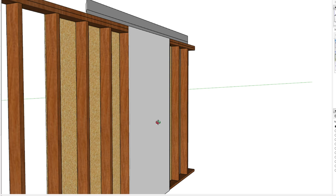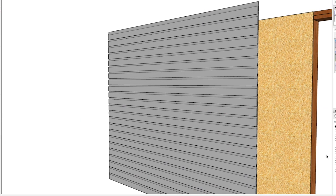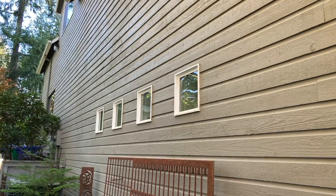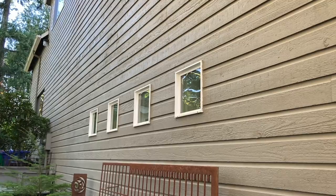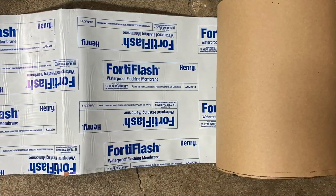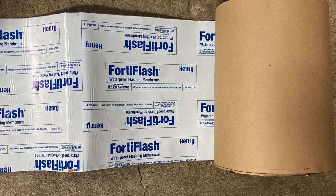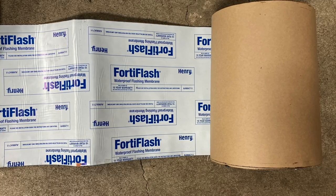The wall I had to work with was cedar lap siding on the outside, half-inch sheetrock on the inside, two-by-six wall, 16 inches on center. In order to flash those properly, I used this sticky-back flashing tape — it comes in 8-inch-wide rolls and works great. What I had to do was remove about six courses of the siding to expose the building paper.